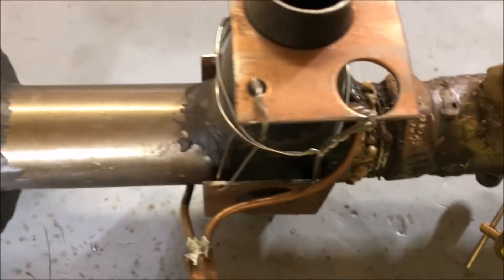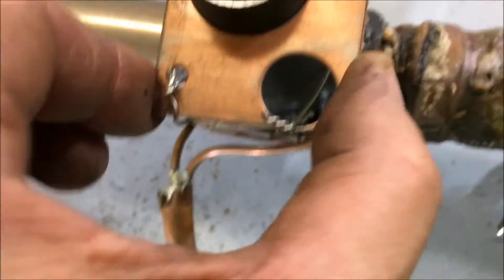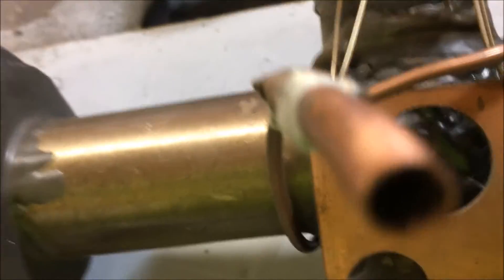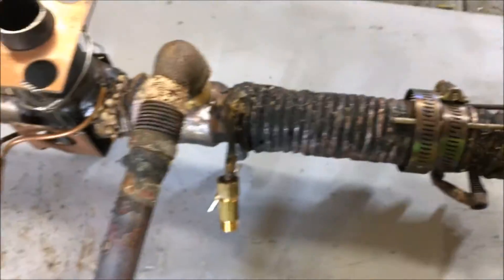What happened was some of the leaks that sprung on the top end here allowed combustion to start right there in the lens — it looks like both lenses are cracked. I'm going to tear this thing down. We're going to have a look at the ash column and see what happened inside here. JB Weld and all that is pretty much destroyed. This area got very hot. Most of my combustion was taking place right here in this upper area versus down here where the inlet is. There's a clog in here somewhere — we're going to find it.